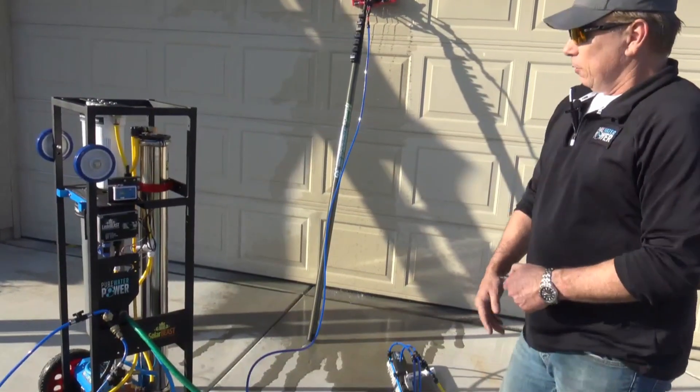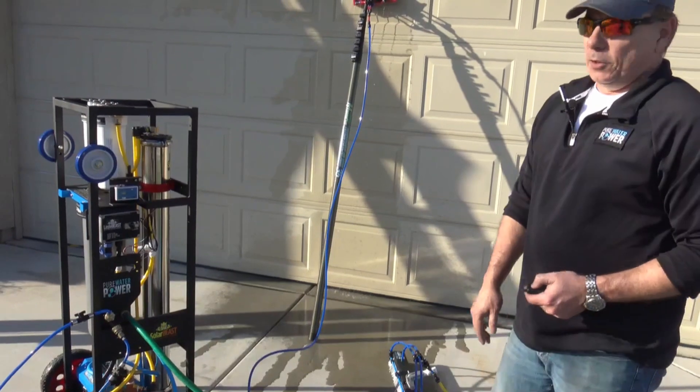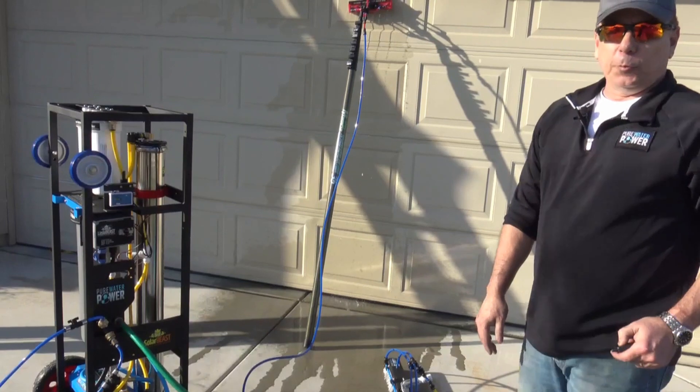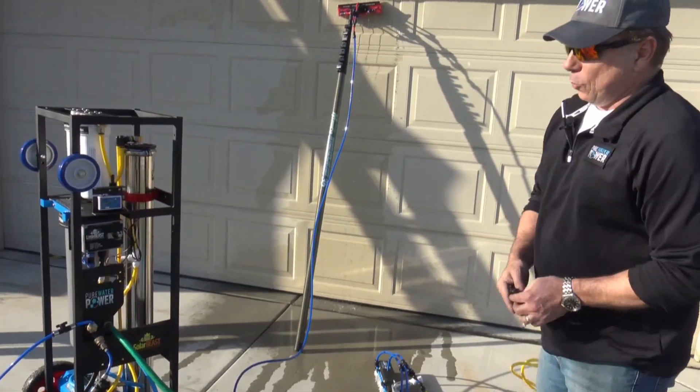So if you're on the rooftop with a heavily soiled solar panel, or cleaning heavily soiled windows around the side of a building, you can turn the pump on for your pre-clean, then kill it to regular tap pressure for your rinse. This lets you save your filter life by dialing in the way you want to use it.